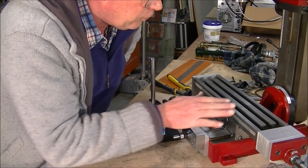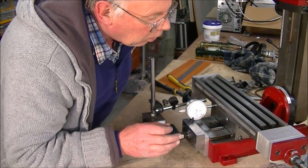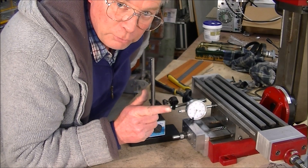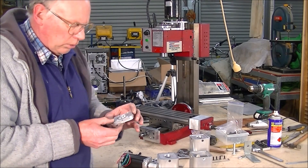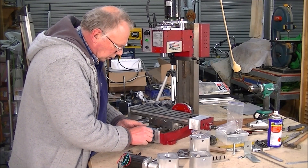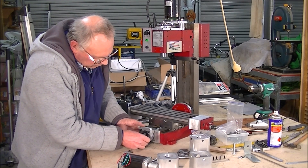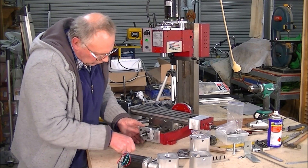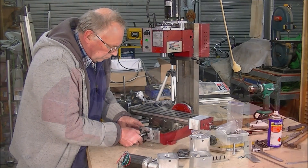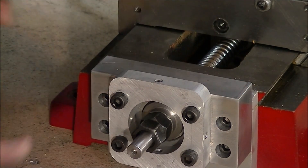I believe that this machine you should be able to get to within a thousandth of an inch of machining operation without too much difficulty, which for a machine this size is pretty damn good. The next thing to go on is this flange plate. Don't forget I did these holes slightly oversize, so I can actually move it very slightly to line the center of this up with the actual zero backlash flexible coupling. You can slightly move it half a millimeter in any direction — that'll allow for perfect alignment.